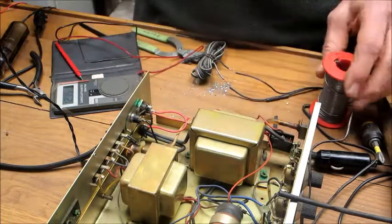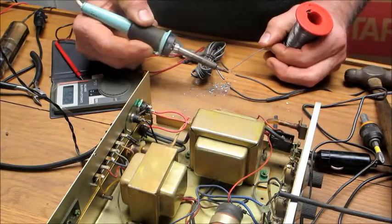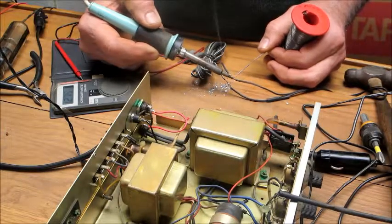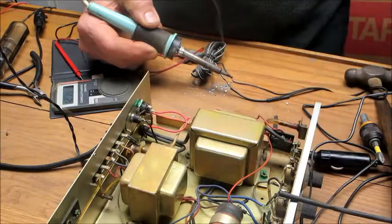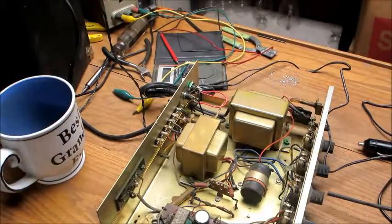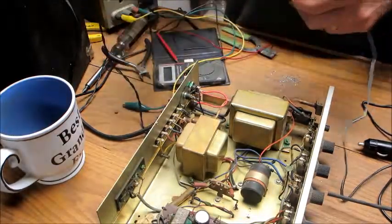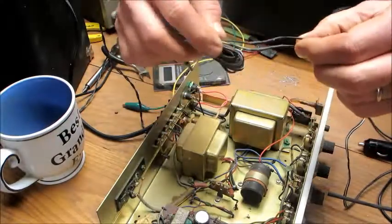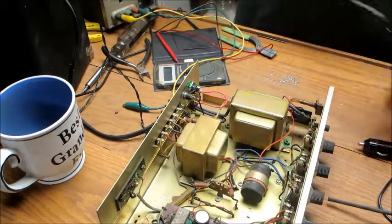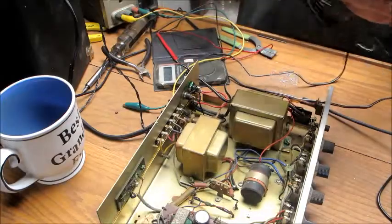If this was higher voltage, I'd stagger these joints so there'd be no chance for bare contacts ever coming together. Being 12. Alright, I don't know if you missed that. Camera just shut down by itself. But what we did is we took those wires I was talking about and I did white to white, black to black, which gives me about a 12 foot long power cord here to a regular lighter plug.